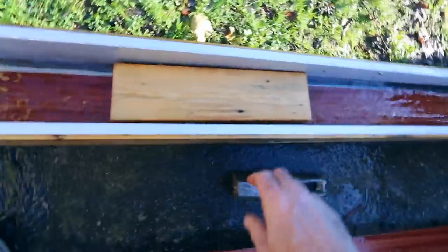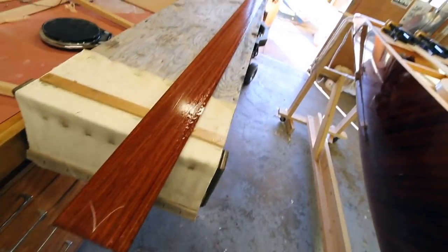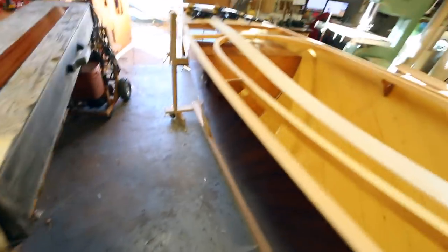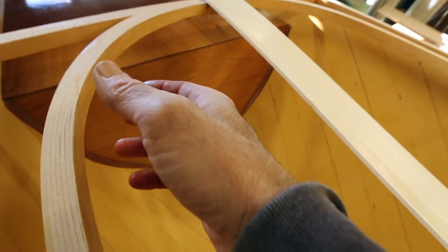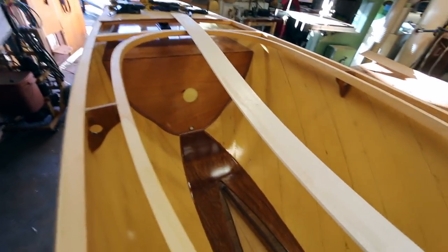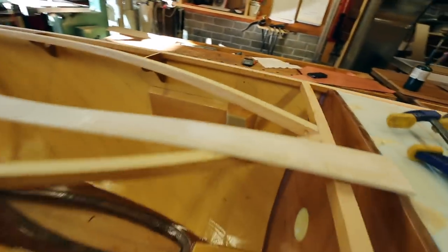I'll leave one in the tank and bring the other inside. The steam generator is rolling. I've figured out which end I want to go forward and inward — I've got bookmatched pieces and these are only about 3/16ths thick. I'm actually going to build up this combing rather than trying to bend a heavier piece of material into this tight bend. I'll do the 3/16ths on the inside, then a layer of eighth-inch plywood against it glued together — that's going to give us a ton of strength. And I have another piece of mahogany that's quite thin, less than an eighth of an inch, that I might bend to the inside for looks.